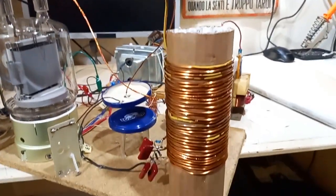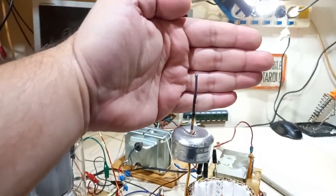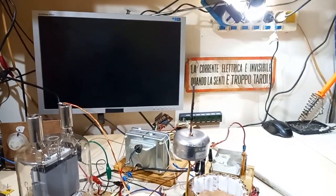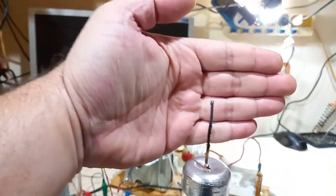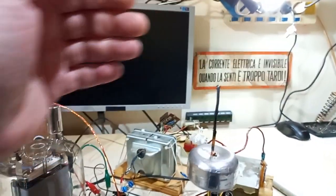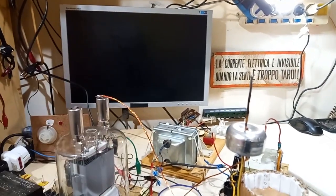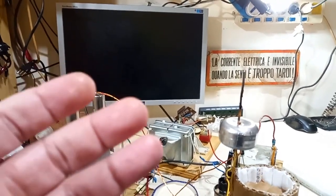About the performance I gained with this coil, I'm getting about 22 centimeters of arc in free air — probably even more. And this without anything on the electrode: no salts, no glass, nothing — just the copper. I think it's cheating doing that — I don't know why people do that, you're burning stuff in your coil — but anyway.